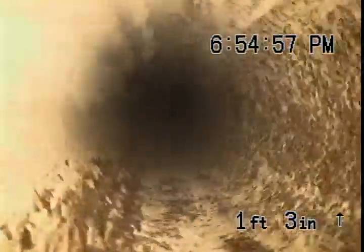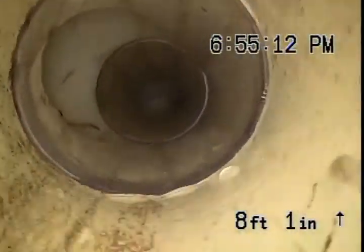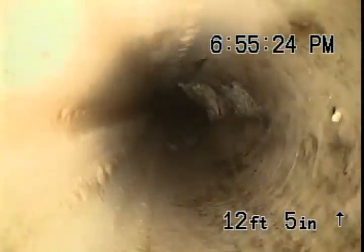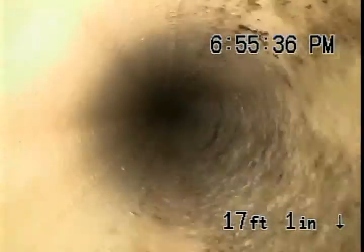3099 Deltona, going down the kitchen vent after jetting. Kitchen sanitary looks great — still not sure what that one was, and a little black staining but nothing major. Here's a problem area we're gonna work on now: top of the pipe has some hardened grease that's not so fresh.